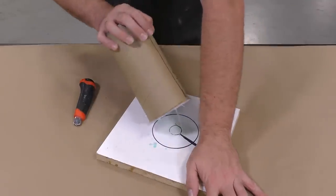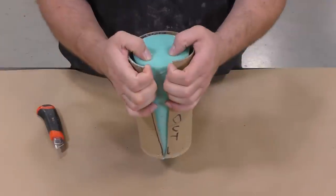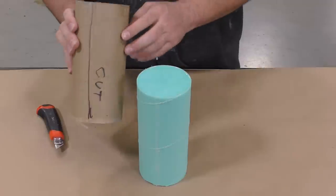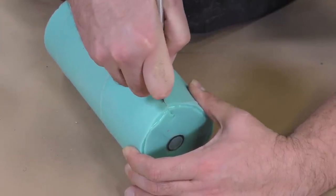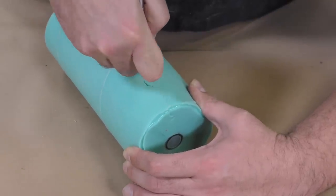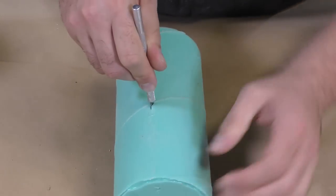After four hours, our silicone has fully cured. I'm going to start by demolding our model — remove the cardboard tube and support shell, set that aside because we'll need it later, and then cut the mold open using a mold knife, cutting it in an S-curve.